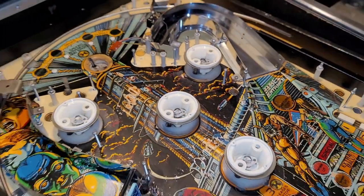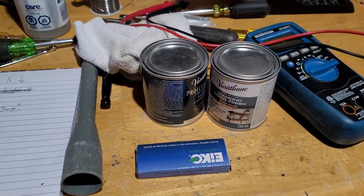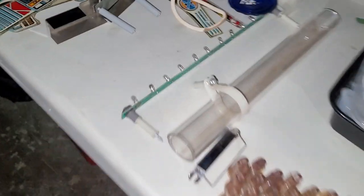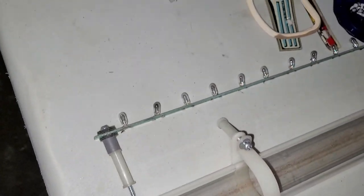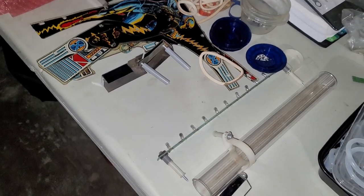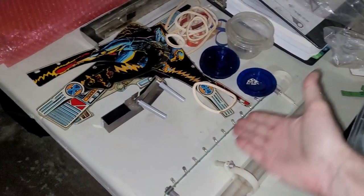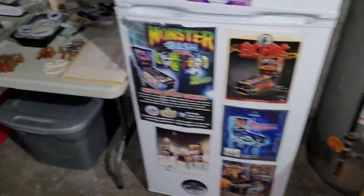This video is taking place over several days. In terms of the Xenon tube lighting PCB, there are a few ways I can go about it: buy a new one, buy incandescent bulbs to replace the burnt-out ones, or buy all LEDs and add a diode. There's a good write-up on that — Vids Guides on PinSide — tells you how to change all these to LEDs for about 51 cents plus shipping.